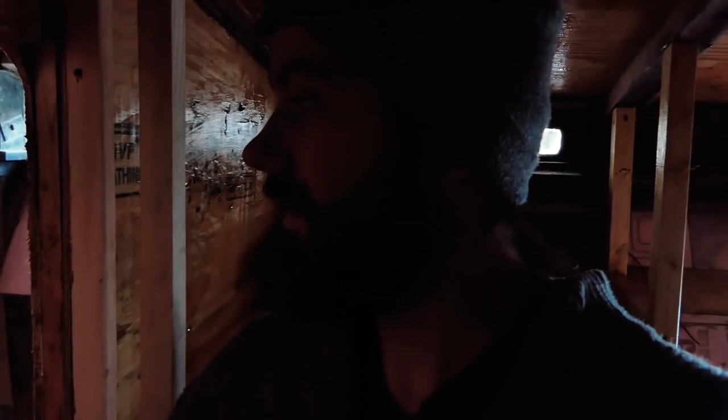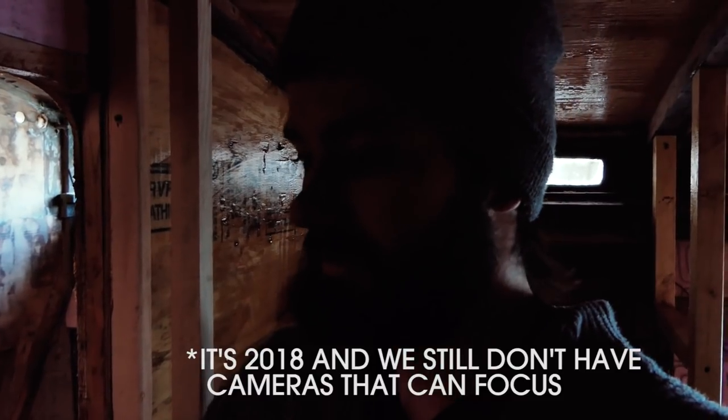Okay, so structurally we're doing a lot better over here. I would show you, but a lot of this epoxy here is drying. If you check on the inside wall here, put the skin on, it's almost everywhere and it's coated in epoxy on both sides. Same thing over here, it's coated in epoxy on both sides, and there's about an inch and a half of Douglas fir that's also coated in epoxy and some insulation in there. So just a reminder, this is the main structural bulkhead kind of in the center of the boat. It's not pivotal to the original Wharram plans, but to my new plan with this big cabin above, it is pivotal. And so I've strengthened the crud out of it.